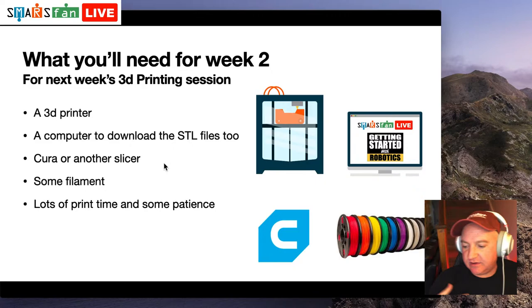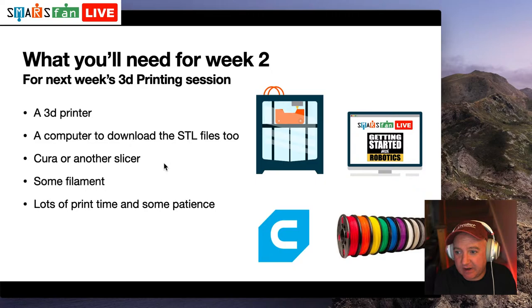So for the cost of a Raspberry Pi, this will run on like a Raspberry Pi 2 or 3. They don't have to be very powerful. I don't think they would recommend to use it on the Raspberry Pi 0. They're not quite powerful enough to do the printing. You can get some issues with that, I believe. So Raspberry Pi 2, 3 or 4 is great for OctoPi. And it has a web interface, so you can drag and drop STL files or the G-code files that will be produced onto OctoPi, and it'll start the printing from there.